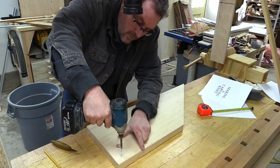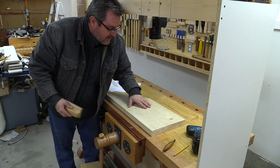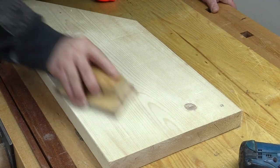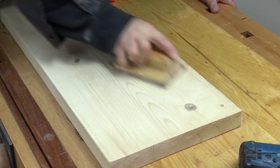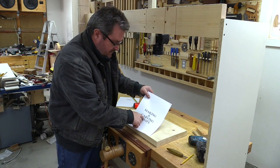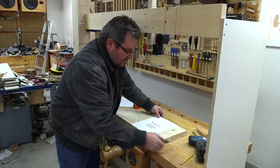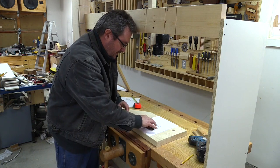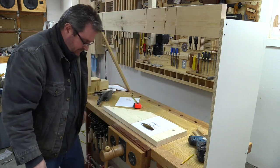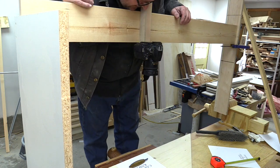I'm just going to make sure I'm well out of the frame. This is pretty clean and smooth but I'm going to take my sanding block and sand it down a bit to get rid of some of these ripples from the cutter when they cleaned it at the mill. I need to position my template, which is just a printed sheet of paper with the letters the right size, and that has to be centered. At the very end of the carving I want to place the knife right below as well, so I need to leave space for that. I'll get up and look through the viewfinder again to make sure I have enough above and below the frame.